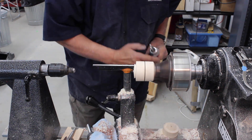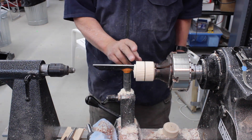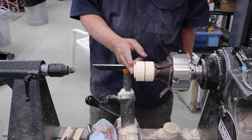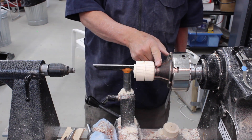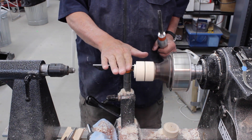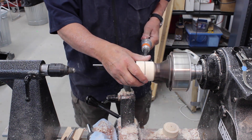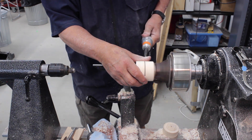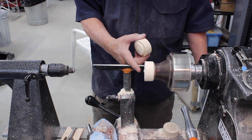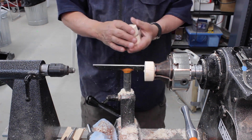There is one roof section. I want to make the comment especially for new turners: it's a little bit trickier or dodgy to part these off between centers. I choose to do it like this - I've got it in long nose jaws and it's a little bit safer. This is not going to get jammed between your tail center and the wood. I did most of the parting when they were between centers. I got three going and I can make 15 or 20 of these if I want to.